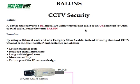There are many benefits to using baluns in a CCTV system. There is lower material cost — Category 5E and Category 6 cables typically cost less than RG59 or RG6 coaxial cable. There is also reduced installation time. An RJ45 plug compared to putting a compression or crimp-style BNC connector on a coax can be put on a lot quicker. Also, the punchdowns, the IDCs, and the clampdown connections for the baluns are tool-less connections.